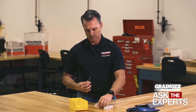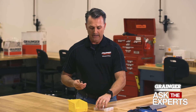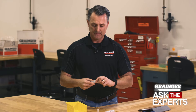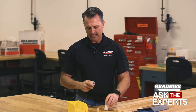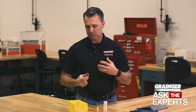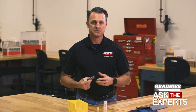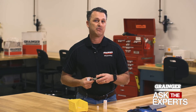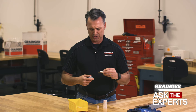Once it's used — whether fully consumed or going to be reused — when you bring it out of the machine and it's going to be stored away, it's best to put the tool back in its original packaging. That'll protect the cutting edges for the next user so you get the best and fullest next use out of the tool. Also, if the tool is fully consumed and is to be sent out for regrind, this will maximize the number of times it can be reground, because if those cutting edges are chipped, it may not be regrindable after its first use.